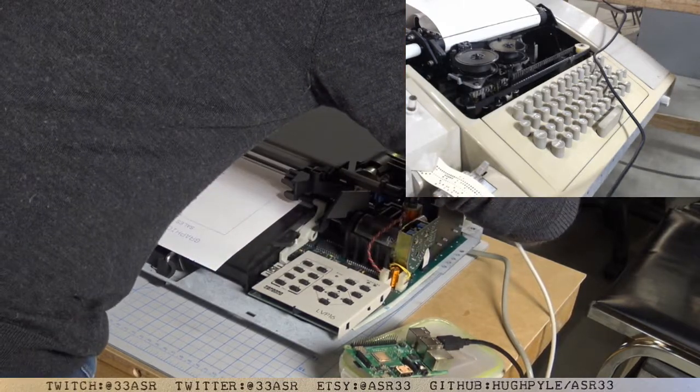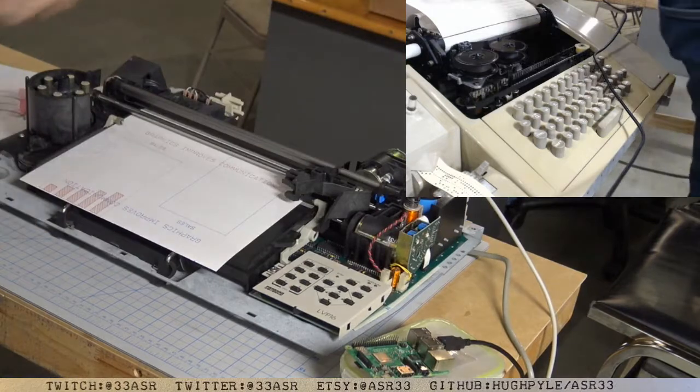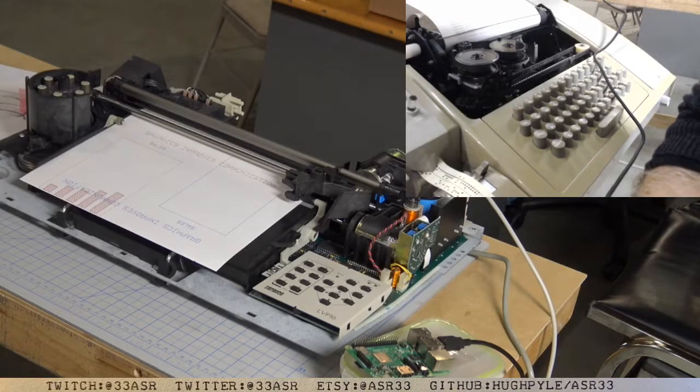Okay. All right. And then there's parity settings. Who knows if they're important? Let's try this with the right baud rate, because 1001 is not even... Oh no, it's 4800. The 1001 that it was set to is a 4800 baud, and that's probably enough to make it fail.